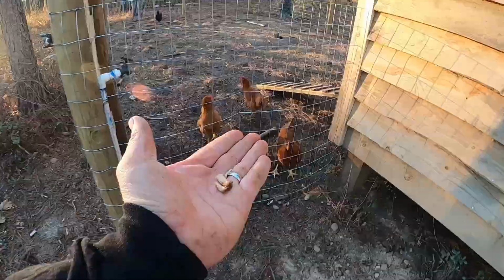Some of y'all are probably wondering why I'm milling up this buggy stuff to put in the house. Well, the termites that we saw earlier, termites don't live apart from their colony. Once you separate a termite from its colony, it can't live on its own and it's gonna die. And there's not any termite activity in our house because we've got those bait stations, and that's pretty well annihilated all of the termites around the house area. These beetles right here, these pine beetle larvae, they're not gonna survive either. Number one, it's larvae that'll possibly eventually turn into a beetle, but once that wood dries out, they really don't have a habitat to live in anyway. This wood's not going to stay buggy, and these are not going to be a threat to anybody.